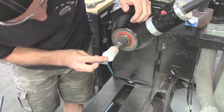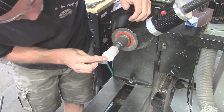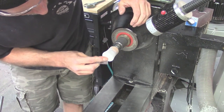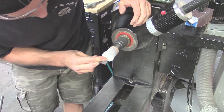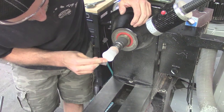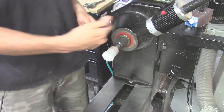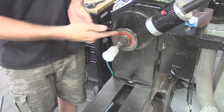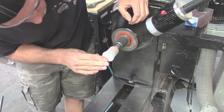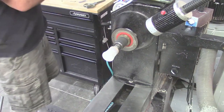But I think most people actually like the Harbor Freight lathes. There's one that's super cheap and it has weird attachments, which would be a pain. Just make sure you get one that takes the standard attachments and things. Morse Taper 2 is common for the inside of your spindle, and then a 1-inch, 8 threads per inch thread on the outside. I would recommend looking for something like that.